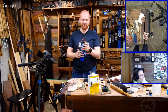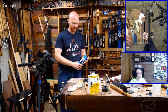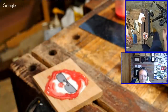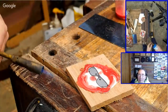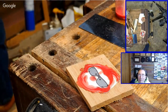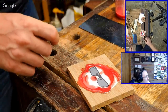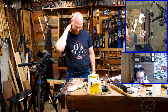I've got something else to show you — we're actually going to be working with some fire here. One of the interesting things about epoxy, particularly with West System, is that it gets all these bubbles on top. It's fun to come back in later and pop them — I'll just come in with a torch. When I run the heat over them, all the bubbles suddenly pop and I get a nice clean surface on top. Then we'll let it sit for about five to ten minutes and come back and hit it with a torch again. Some people use those little butane torches.